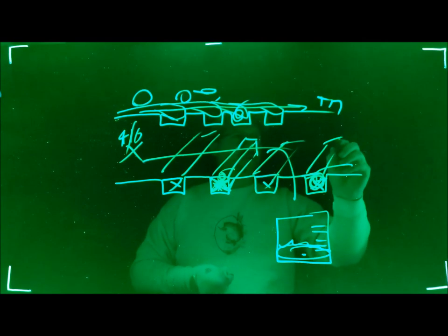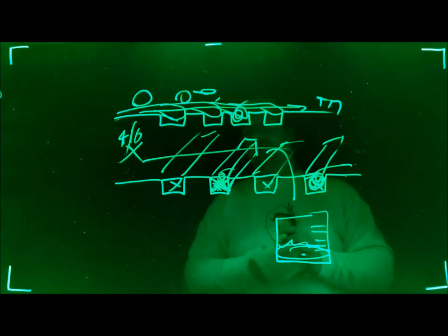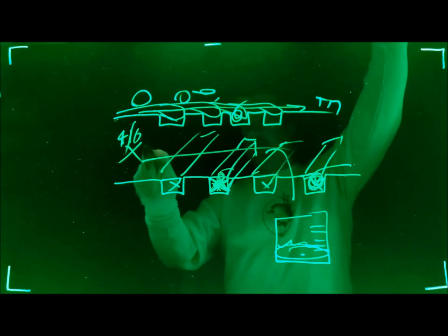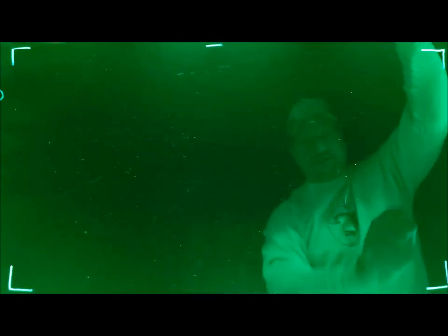So you have to run it in proportion to its processing capability, or its area or its volume that it can handle. That's its area of active exchange. So we felt that these guys here were kind of an illusion. They were like a snapshot in time. They were only processing a portion of the material every time. Even though the recovery might have been good for that stuff that fell in there and got caught, and we worked it out, it held that gold in there, but what about all the stuff that slid over because you exceeded the volume? Now, if you want to go process slow and you want to process less material, you can run it to where it would never overburden. But we wanted to shovel stuff in. We wanted to move as much material as we could every time we went out. That was the goal.